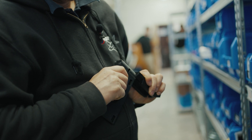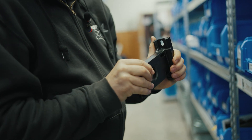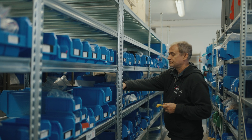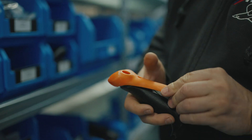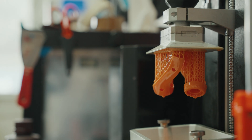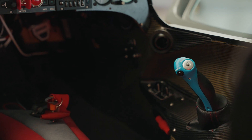Sometimes the canopy is closed and temperatures can go quite high. Some parts in the motor cooling we print with nylon. Some small details are even printed with PETG and PLA, but those are really details not actually installed in the aircraft. We are printing the grips on the control stick and the throttle. In the past we produced those with cast polyurethane in silicone moulds, but that requires quite a lot of labour, the silicone mould had a limited life, and it was very difficult to produce a new one.